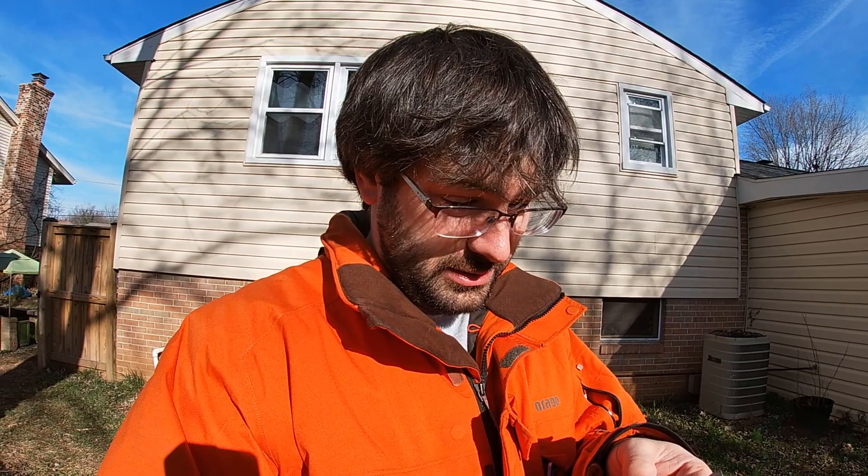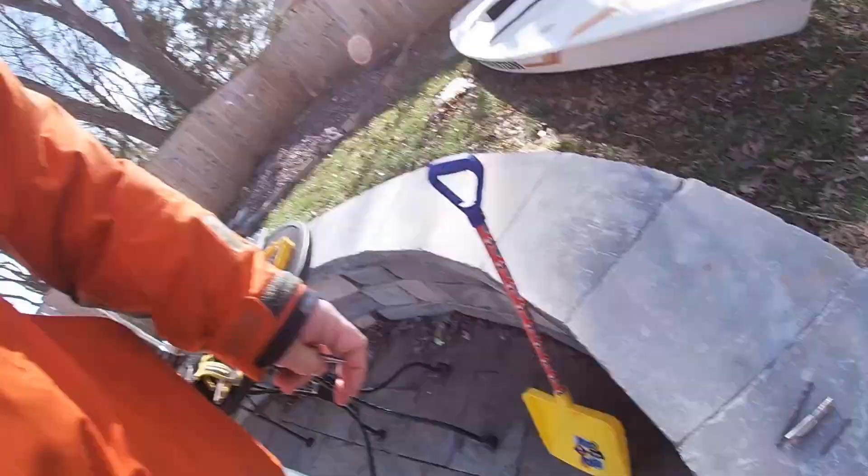So I went to the hardware store after breaking my third drill bit on four holes, and I got this step drill bit. These things are amazing. If you're drilling thin steel, go get a step drill bit. I didn't even need a starter hole, though I still drilled a small eighth-inch pilot hole. These will drill a hole to whatever size I want faster than it takes to chuck up and change out a bunch of twist drills working through all the different sizes. And they cost about as much as a twist drill kit — which I've already broken two bits out of. They just make short work of it. This thing cost me 20 bucks. Best 20 bucks I've ever spent.